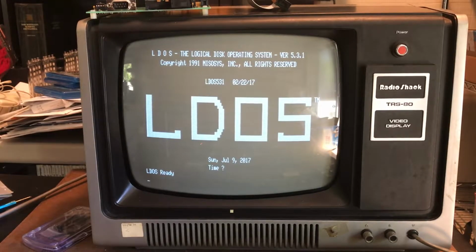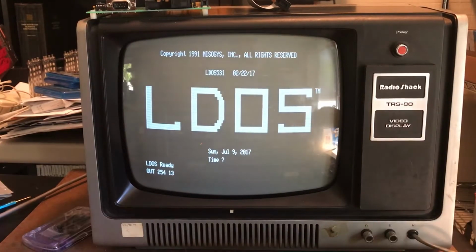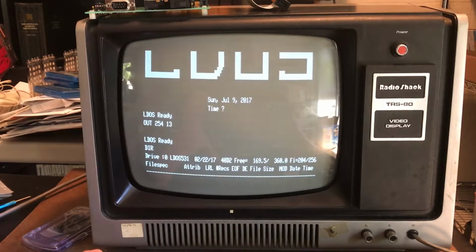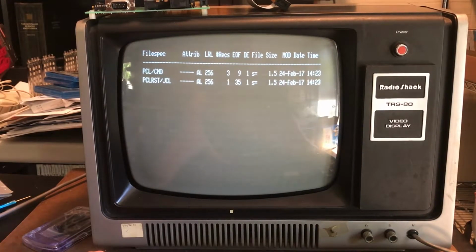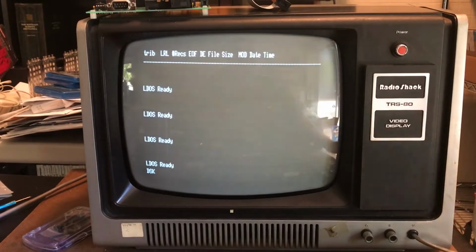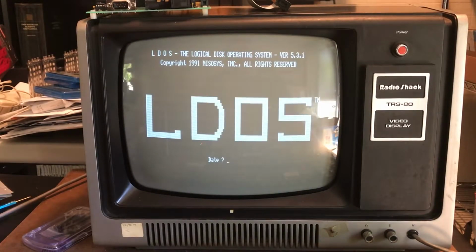So I'm going to kick the system up to 3.55 megahertz with the wait state, out to 5413. And I expect core functionality to be here. We're accessing the floppy, so the clock's back at 1.77 megahertz. Everything looks normal. And we know the DSK utility had issues being overclocked at 5.32, and it has issues here as well. There's no surprise that the utility fails. The utility, as I said before, is bridging the SD card and the Model 1 disk subsystem.